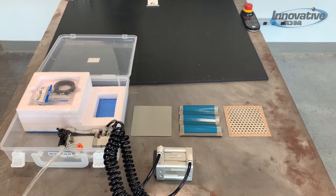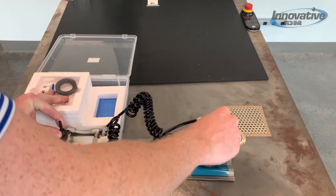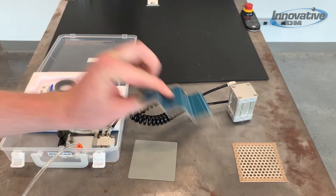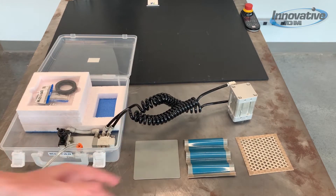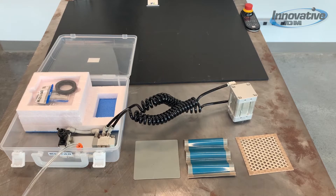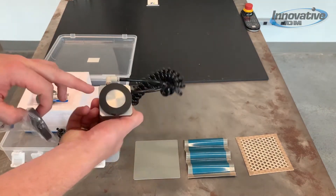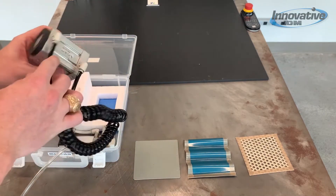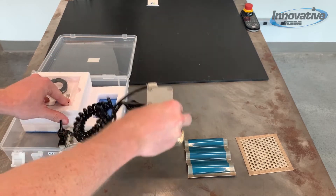If your object is one and a half millimeters thick, it'll boost that holding force up to 120 newtons. Let's give it a go — some pick and place. No trouble picking up your standard piece of metal, an angular piece of metal, and a punched-out piece of metal. Now, if that 120 newton holding force is a little too much, you can use these rubber seals to space out the distance from your magnet, giving you the ability to fine-tune your holding force. All this really is is an air-operated cylinder sending your magnet down to the base, and once it gets there it lifts. Easy as that.